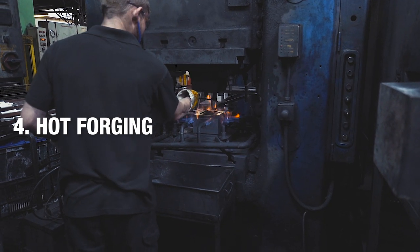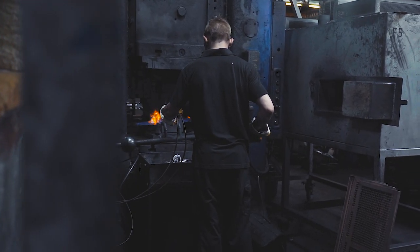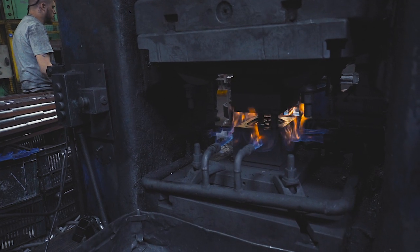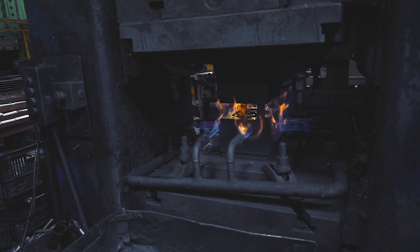That batch of biners gets heated up. And then the press itself — it's a big, strong press that can do a lot of force. It's also heated up to a similar temperature, so we've got a big lump of hot metal smacking into the round bar, which is also hot.